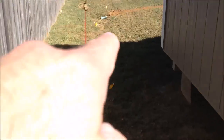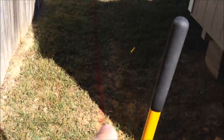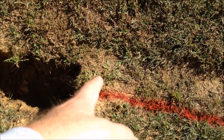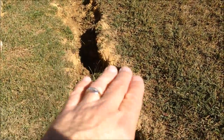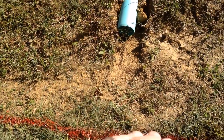I've got everything measured out, but the cost was going to be a little prohibitive, so we decided to break it up into a couple of smaller projects. Today I'm going to do the two recent gutter pipes that I ran to the ditch. I'm going to put a 90-degree elbow, bring it out of this pipe, and you can see the red stripe going up the yard — that's what I'll follow. I'm going to have to move the ditch over a little bit. That's going to be 4-inch pipe to a certain point, then a 6-inch to 4-inch reducer, plugging the 4-inch half so it dumps into a 6-inch pipe. The next phase will have grating and a 6-inch pipe to accept heavy water, but for now we're just using 4-inch pipe to get these two gutter pipes piped to that point.